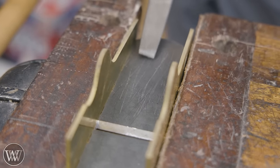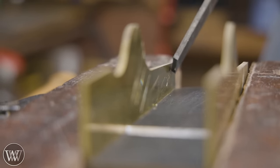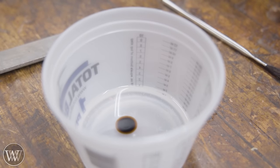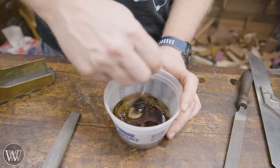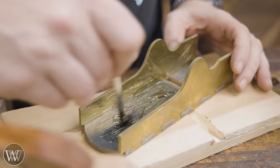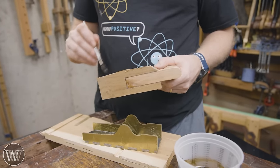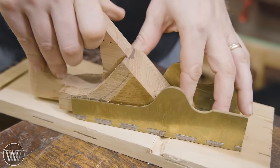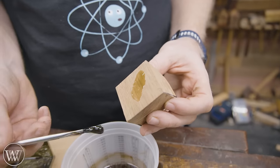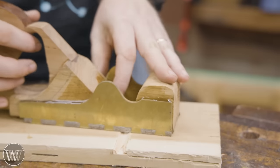Before actually gluing it into place, we need to scuff up the steel and brass where it will be connecting, giving the epoxy a bit of a place to sit. You could do this traditionally with hide glue — it actually works very well for the connection. But I like to use epoxy here, and I'm also going to add a little bit of dye to it because there are a couple places where you'll see a little more. This translucent dye will add a bit of coloring that makes it disappear with the oak beside it. I'm going to apply it to the brass, steel, and the wood body, then wiggle it all down into place and set it aside. It's a really nice tight fit so I don't have to worry about clamping.